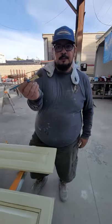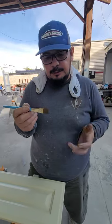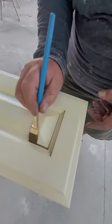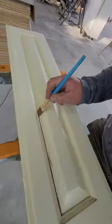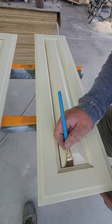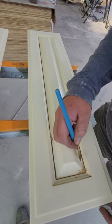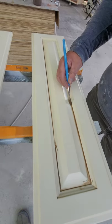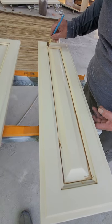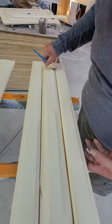I'm taking a small artist brush - I typically like a 45-degree brush, but I give a bunch of them away to my customers for touch-up afterward. I'm just going to take my line on the inside here. I'm not really worried about getting a super clean line; I just want to get the color in the edge. I kind of just wet it over the edge a little bit, and with the angle of the brush I'll let it come over the edge of the door just like so.